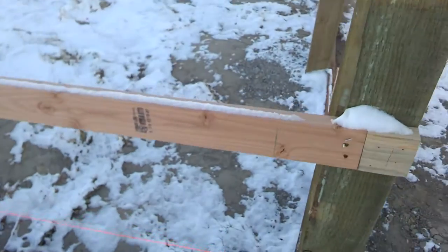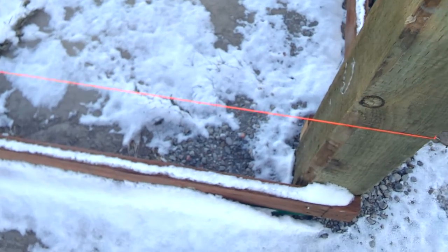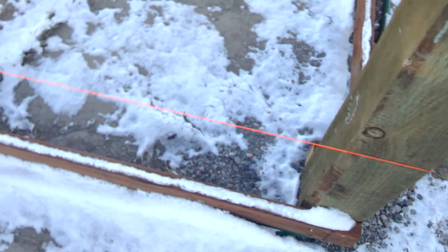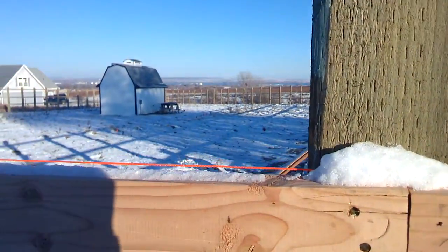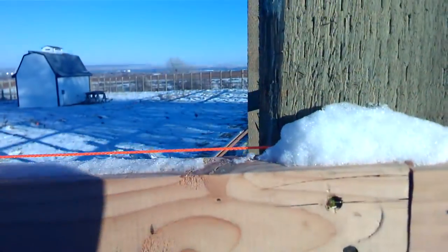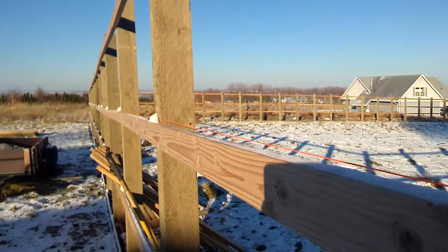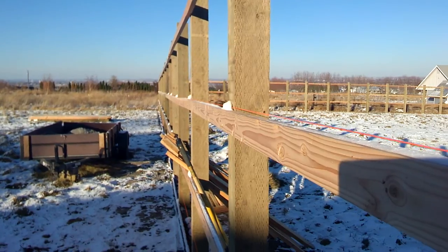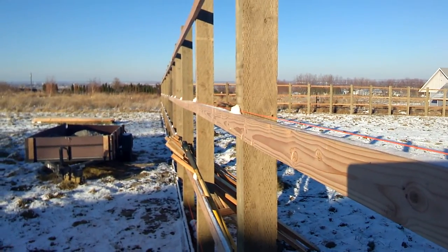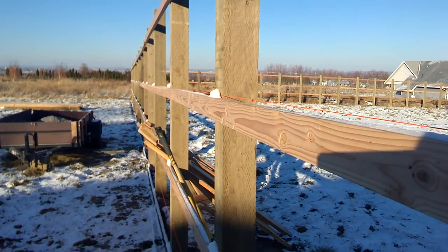You've got to do lots of little strings. We'd set one at 12 inches above our bottom board, then we did another one up here. And that tells you if you're plumb. We also used a level on there to double check, but the string does a pretty good job getting it plumbed. When there's wind, you need a level.